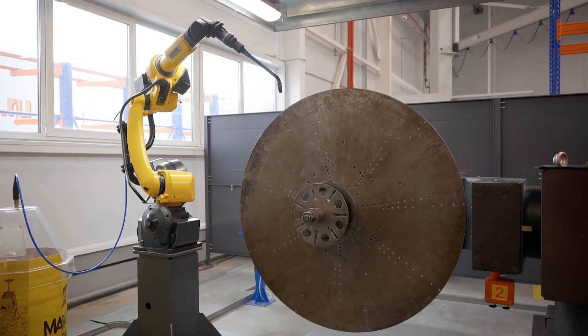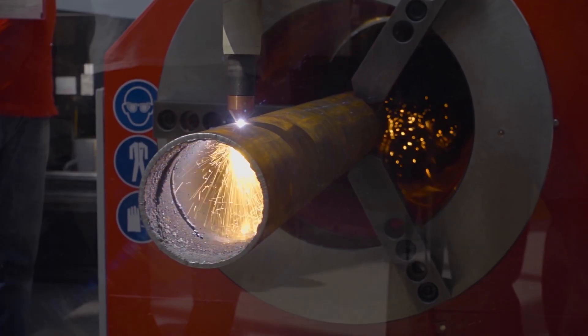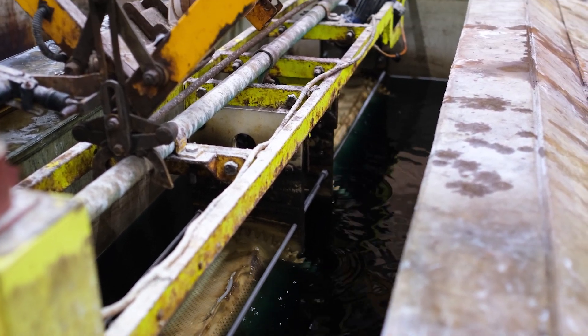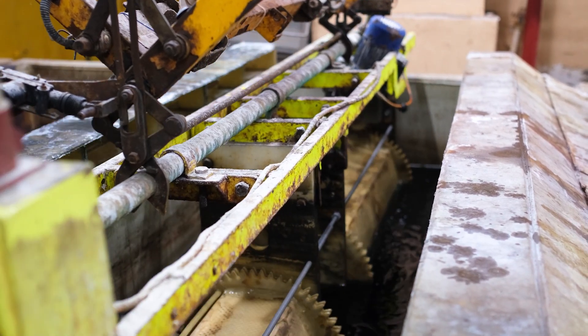Some typical applications where a rotary ground might be used include rotational welding of tanks, pipes, and other heavy metal structures; rotational plasma cutting of sheet metal and pipe processing; and electroplating and other deposition-based applications including heavy manufacturing and semiconductor processing — really anywhere where current needs to rotate within a closed circuit.